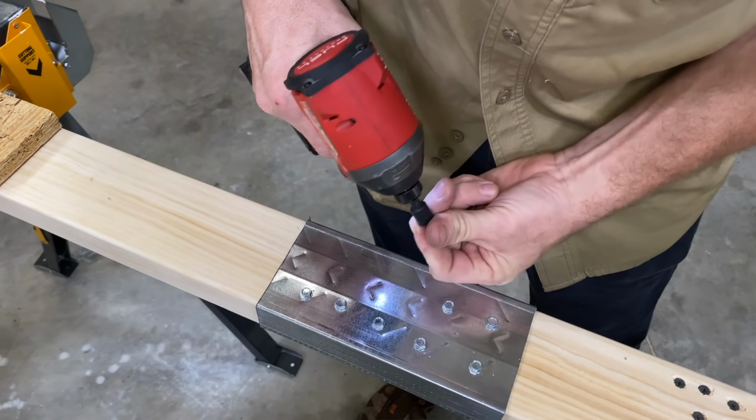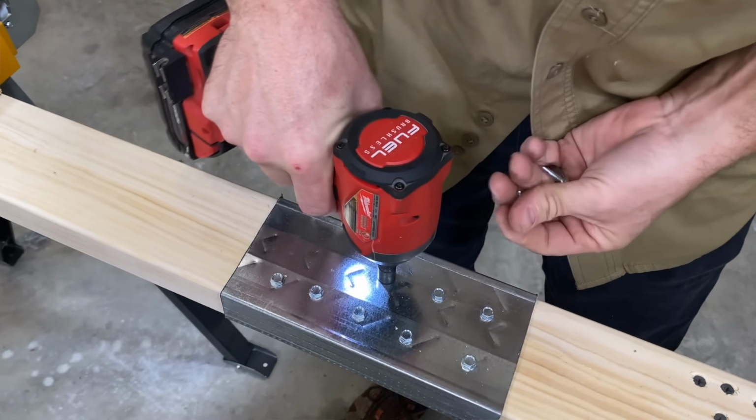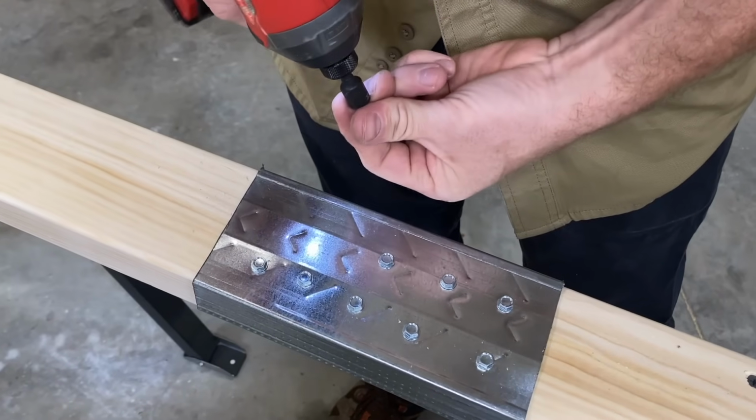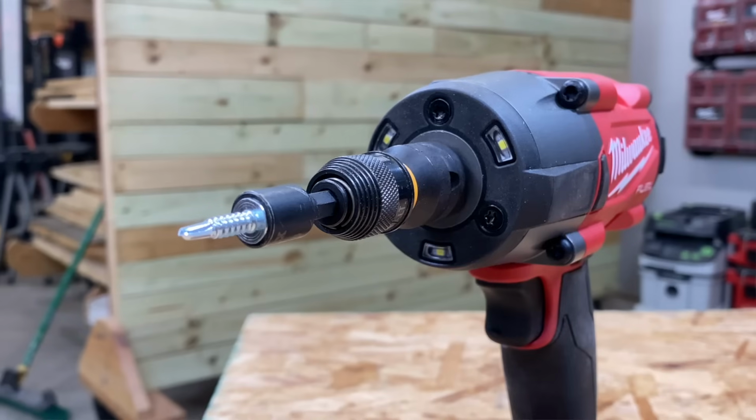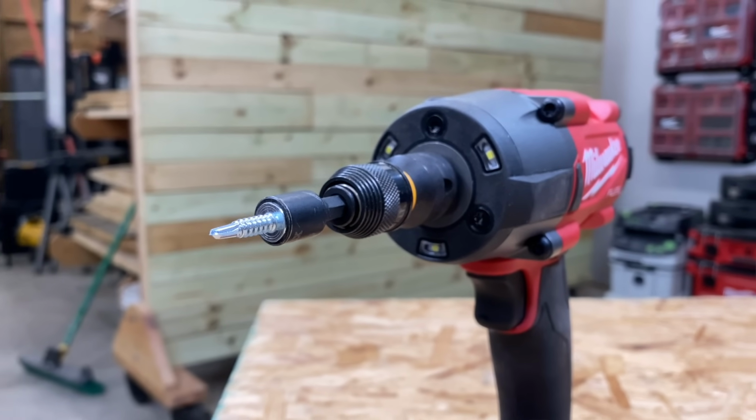There are some exceptions to what we just laid out though. You can get socket adapters or nut driver bits to work with your impact driver and use them on hex head fasteners. You can also get adapters that let you use 1/4-inch driver bits with your impact wrench. But just because you can adapt them doesn't mean you should adapt them. Too much power and you could be shearing off fastener heads. Too little power and you could burn up your motor, or it might just not get the job done.